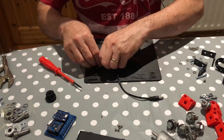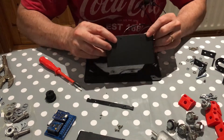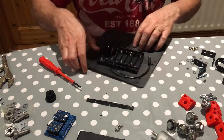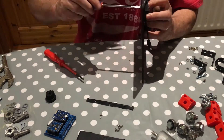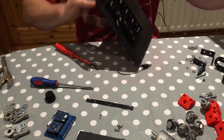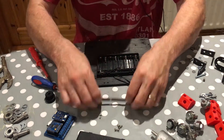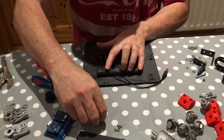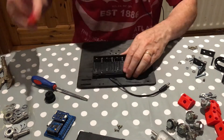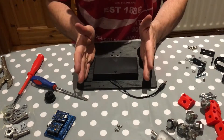To hide the bolts so they don't go through the back of the pack — that would get in the way of the batteries — I take off this little cover. You can see there are a couple of wires in here. I've pre-drilled two holes to match up with the two holes on the plate. We tuck the wires back in, put the cover back on, and that's our battery pack in place.